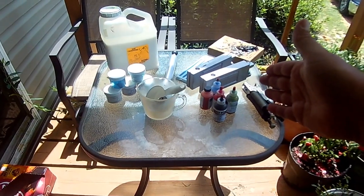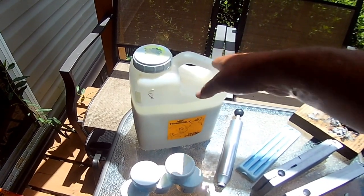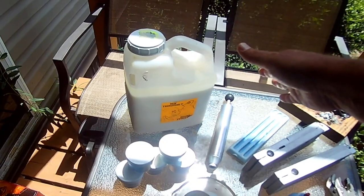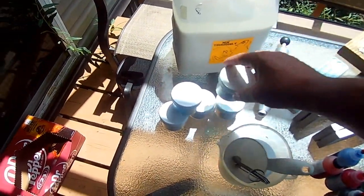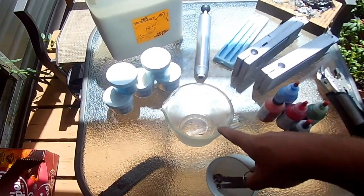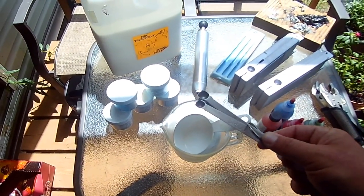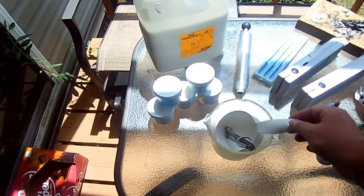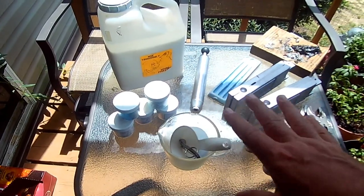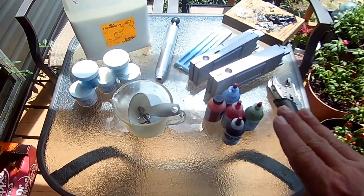This right here is the essentials you will need to begin making your own soft plastics. First up, you're going to need the liquid plastic material itself — it's called plastisol. This is a one-gallon jug; it'll run you about $50, but you will get many, many bags of plastics out of that. This is the glitter — several different types in case you want to add it. I have several measuring devices; I use these for measuring amounts of salt or glitter. This stuff is like baking — it's a pretty exact science. You want to remember your recipes, otherwise even the slightest variation can change the entire consistency of the batch.